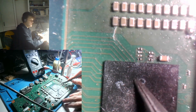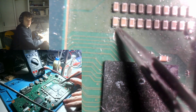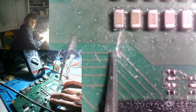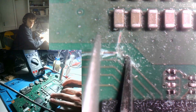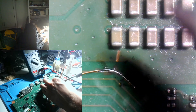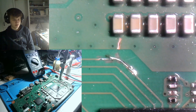I was looking at the Bank D RAM chip — it's this big chip here. And look what I found: someone has slipped with a screwdriver here, so maybe that's our problem. I will zoom in there. We will create a small jumper for that by scratching the traces on both sides. Good, the small jumper has been installed.